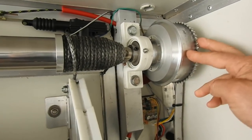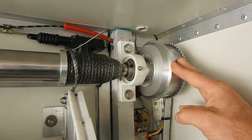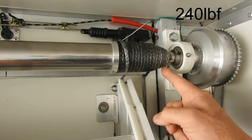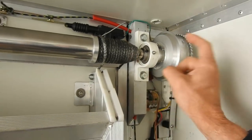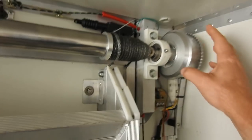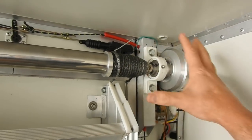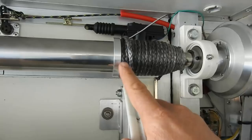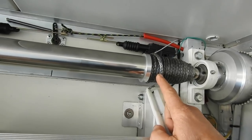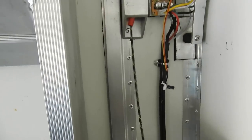A quick overview here: the motor tested at 24 volts — they're 36 volt motors — gives around 16 newton meters of torque, which equates to about 60 kilograms of pull on this side and about 110 kilograms on the other side. You could well overrate these motors and overpower them significantly for short periods. I'll put links and details in the description. This is 6mm rope — actually the Chinese version of Dyneema, so about 70% as strong, possibly good for about 2 tonnes. The rope is tied here and comes down to the exit.